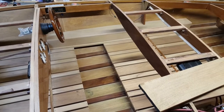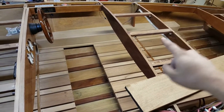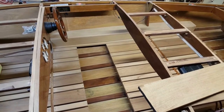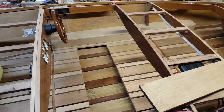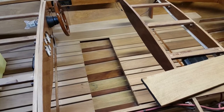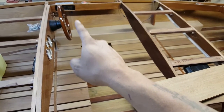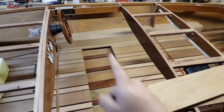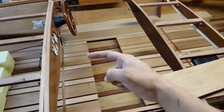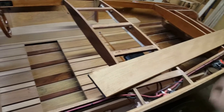Here's a better look at the armrest down the starboard side — it ends right where the floor planks end, and the rear seat will come right down into it nicely. I did these out of one piece — one for the top, one for the vertical. Some guys split them at the frame because it's a fitting nightmare to get everything to clear without monstrous gaps, but I wanted it all in one piece. That's the look I was going for, and it turned out pretty good.